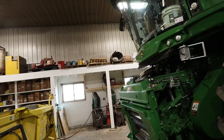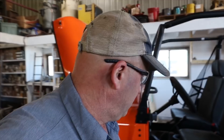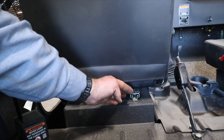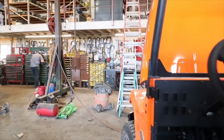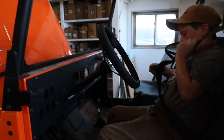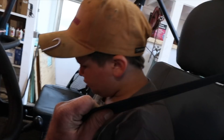We are just getting done making some improvements to the rock saw here. Andrew cannot reach the clutch pedal, so on the seat you can see the bolt plate on the back is set back. We were able to move the seat forward on the bolt plate, which gained about an inch and a half. But once he has the seat belt on, he still cannot push in the clutch. So I ended up making a bracket extension.